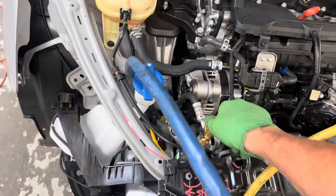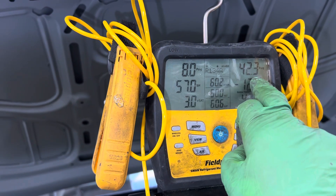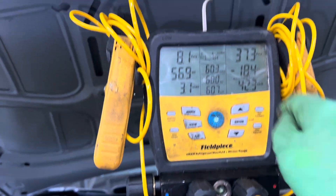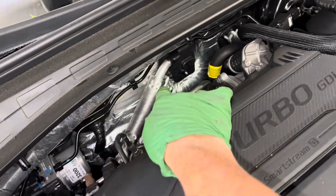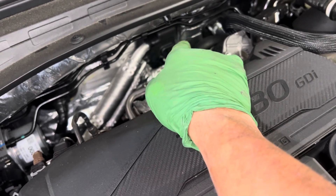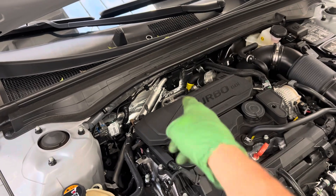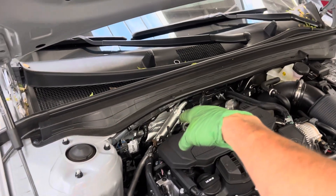Let me get it over there so you can read the pressure. As it's dropping, this side is down more because it's pulling through the suction line. The liquid side is closed — just reading, not pulling. All that liquid has to travel to the expansion valve, through the metering device, through the evaporator. Because the refrigerant level is dropping so fast and at a slower velocity, the oil is traveling with the liquid refrigerant, dumping into the evaporator right now.